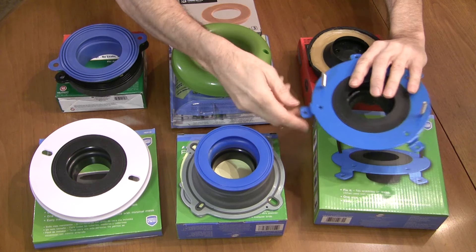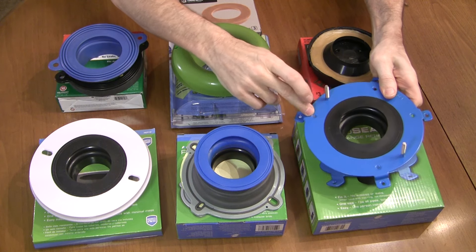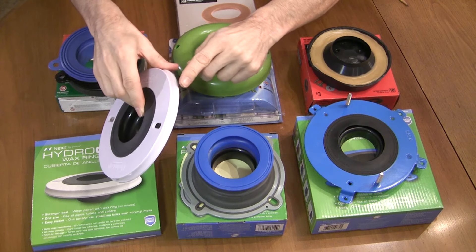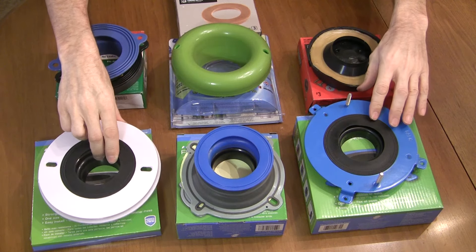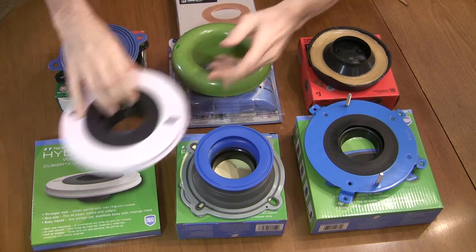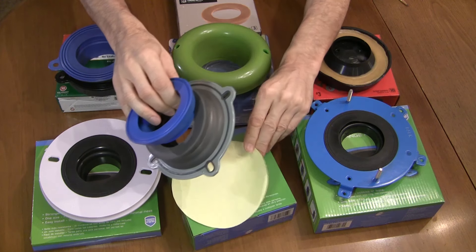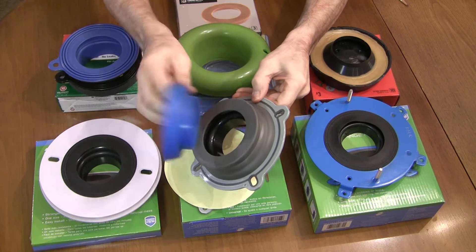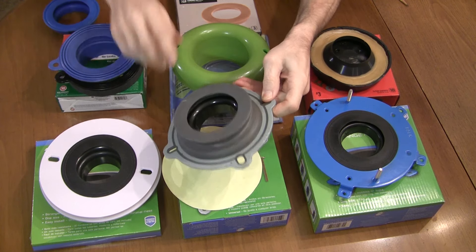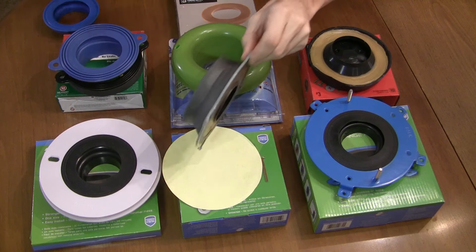I don't want to put screw holes in my floor. These screw to the flange itself through the inner holes, and then you can also bolt it to the floor. Both sit up three-eighths of an inch off the floor when done, and your flange bolts go through here. This one is made by the same company and is called the Perfect Seal. It's an adapter for when your flange is below the surface. This one has a wax seal built in — the seal comes up to here and then compresses to seal off all the area touching the flange.